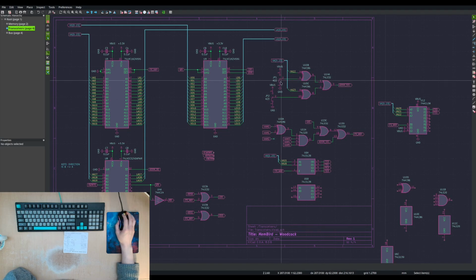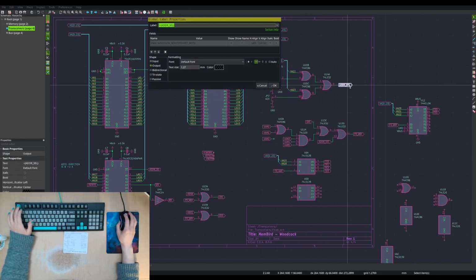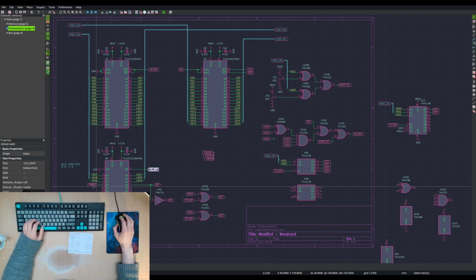Where the upper two address lines tell you which of the four megabyte chunks within the 16 megabyte A24 address space this card's memory should appear in. That will select this address cell, and if the address is selected, then we're basically going to enable the address buffers there, which will also bring these signals in.